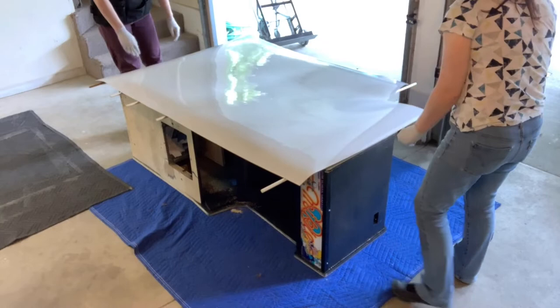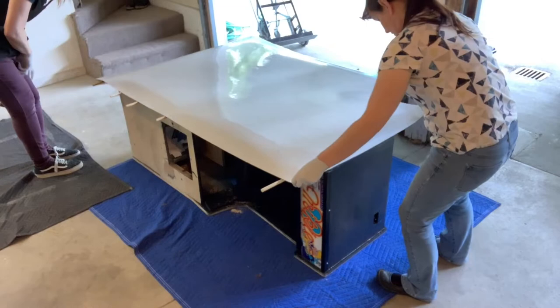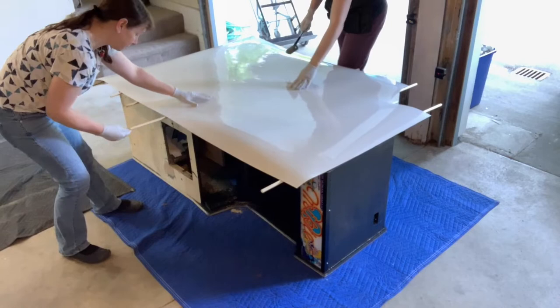You can see us trying to figure out exact placement and make sure everything is covered. The dowels are easily moved at this point. If you just slap the laminate straight down you're kind of stuck — anyone who's ever put a sticker on anything knows that feeling. Once it's all lined up with enough space on each side for the router, take out the center dowel and press it down with your hand, then use the roller to adhere it, getting nice and flush with the rubber J-roller.